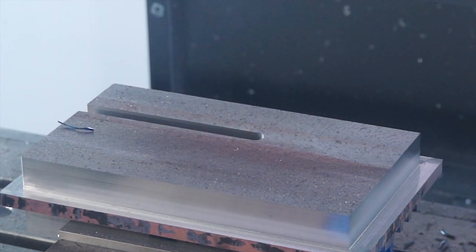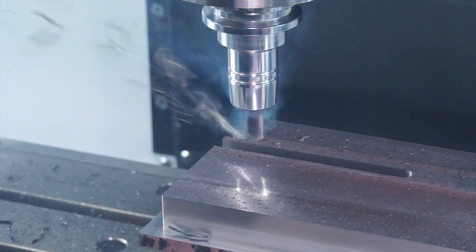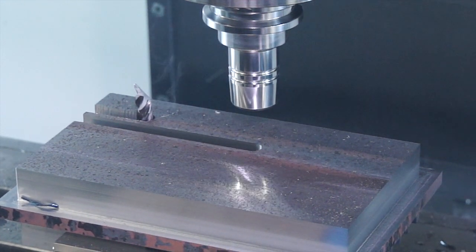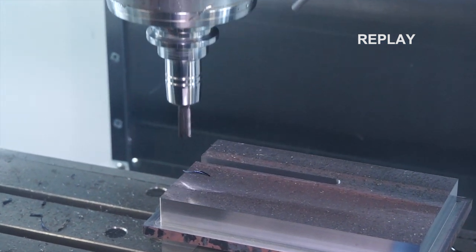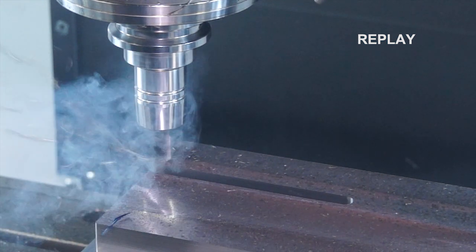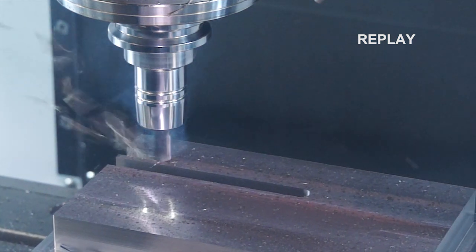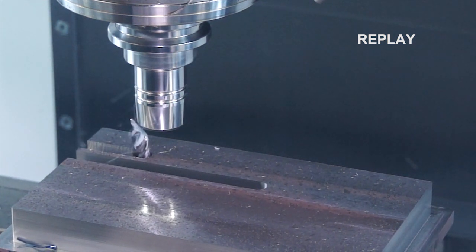Now we want to demonstrate a hydraulic chuck, which is probably one of the most accurate holders available. It is ideal for axial loading. This really demonstrates the point we're making — this is a holder recommended for axial loading for drilling, tapping, and reaming, but not ideal for side loading. Here we see it again in slow motion. Because of the lack of stability in the holder, it doesn't allow us to take high loading on side loads. So although it's one of the most expensive holders, it doesn't mean it's necessarily ideal for this sort of application.